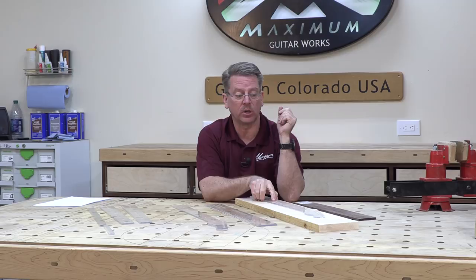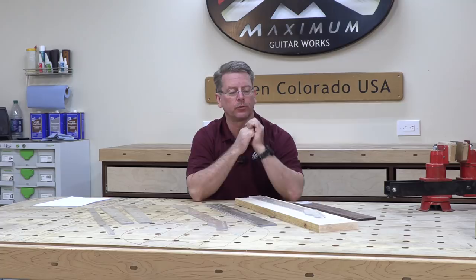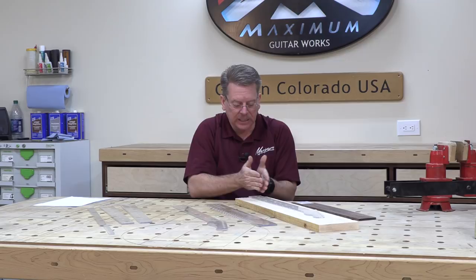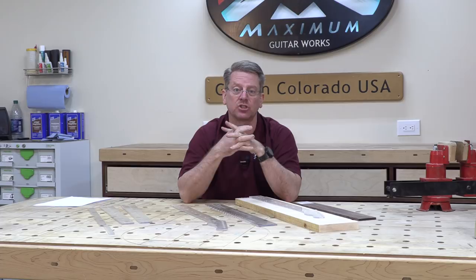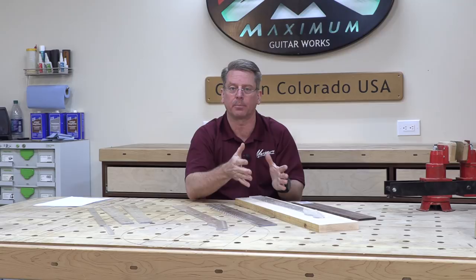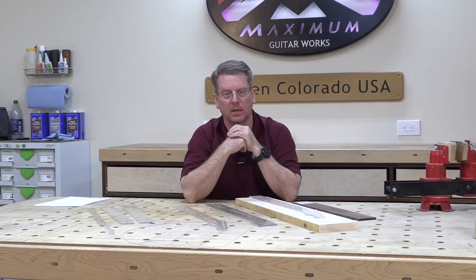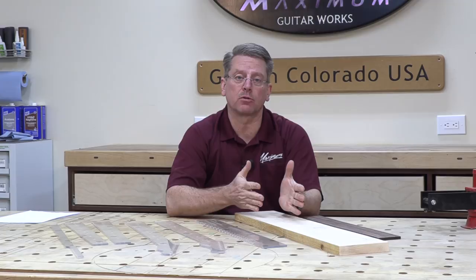For the Telecaster, all we need is about 26 inches long, and we could get away with something maybe three and a quarter to three and a half inches wide. I prefer the four inch because even with a full Stratocaster style headstock, I can take a four inch and lay my center line directly on the center line of the wood and have space for the headstock. The center line working is easier because when I'm routing out the channels, I can line it up dead center and use a router table. So that's why I prefer to work with a four inch piece.